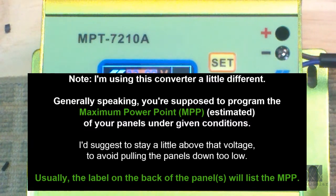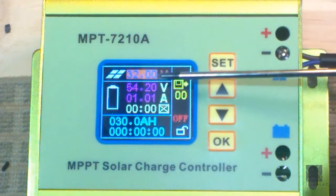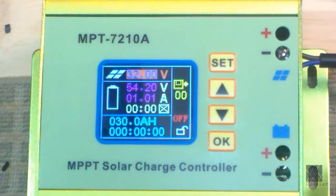You may have to experiment to find that point — this unit will not find it for you. For a 12-volt solar panel, which will have maybe 20 to 21 volts open circuit, you could try maybe 16 or 17 volts and experiment up or down from there. If you get the voltage wrong or the sun is too weak, the symptoms are this unit will reboot continuously. The voltage will go down on the solar panel side — that's the solar panel voltage shown here — and suddenly the unit will turn off. The display will go out and come right back on and try to start over.